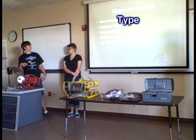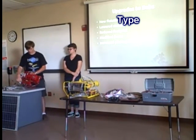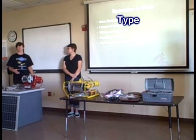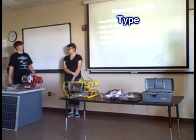which makes the robot much smaller so it can fit in tighter spaces. We also further modified the frame. We moved this thruster back, and we reshaped the bottom of the frame so the robot can actually get in against the bottom corners of a pool or wherever we're driving. All these changes added up to make a robot that's a lot more maneuverable and also a lot more capable in situations that don't require as much maneuvering, but just tighter control and being able to get in tighter spots.